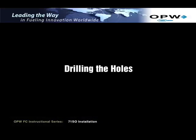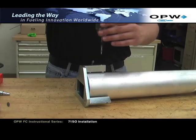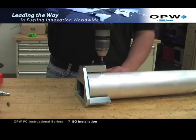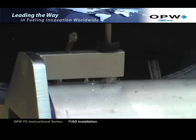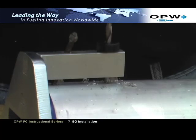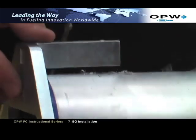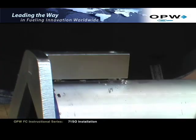Drilling the holes. With the inlet tube and 71SO Tool C in place, carefully drill a 3/16-inch diameter hole in the upper drop tube using the 71SO Tool C as the guide. With the drill stop in the proper position — between 1 and 3/16 inches and 1 and 1/4 inch depth — the bit will bottom out against the tool after drilling through the upper drop tube. You should drill each hole from the 12 o'clock position. Carefully drill all 3 holes, ensuring that the holes are being drilled true and straight.